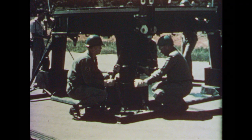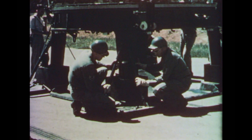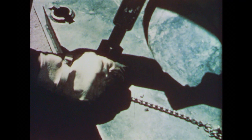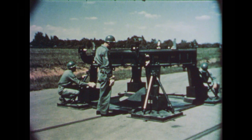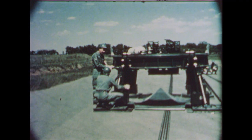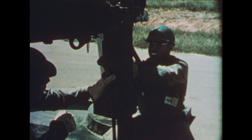At each leg of the launcher, a manually operated screw jack rests on a ball-jointed footplate for good footing. The jack is operated by a ratchet and handle inserted between the leg and protective shield. Turnbuckles provide bracing for the launcher for stability due to soil conditions and to counteract wind loads during standby. Two spirit levels located 90 degrees apart and protected from heat and blast are attached to the launcher body to indicate when the launcher is in a level plane. The four jack assemblies are bolted to the launcher body for supporting and leveling.